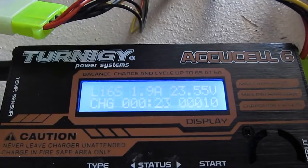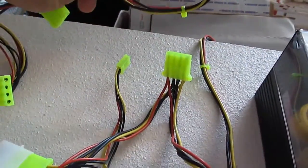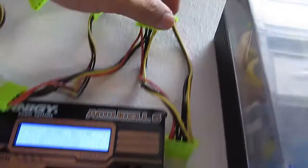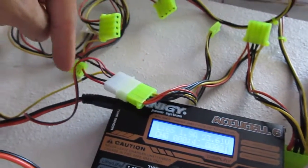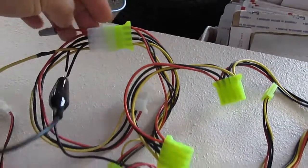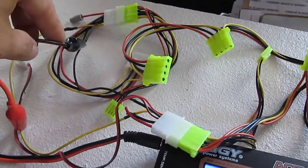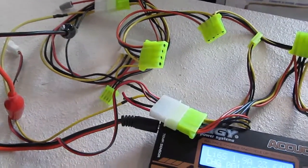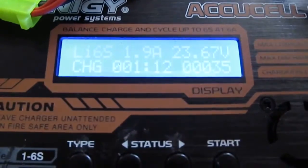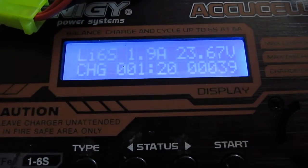That's because it has enough power coming from two different power bundles — two different 12-volt rails. This is one bundle and this is another bundle right here. This extension goes to the same yellow wire and the black wire, and this other extension goes to the same black and yellow wire connected here — this is the yellow wire, that's the black wire. As you can see it's been over a minute and it's running fine, while previously it couldn't even run for a few seconds.